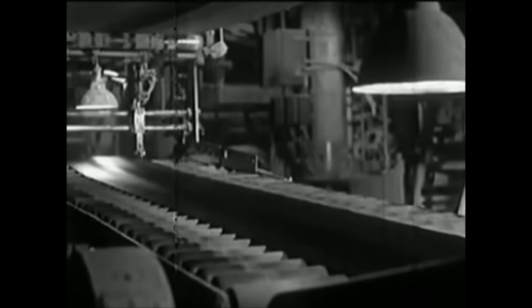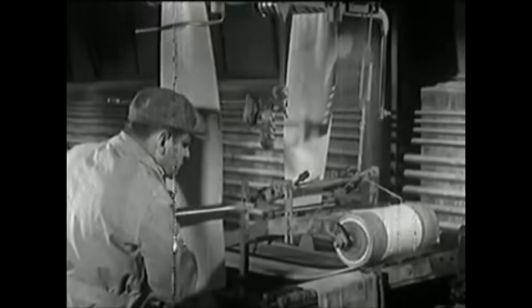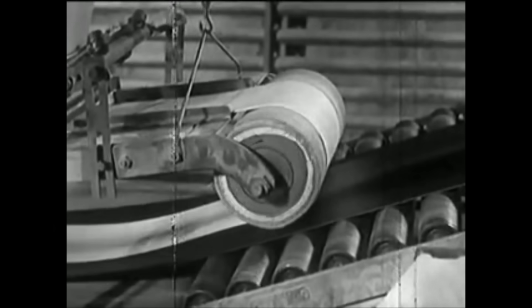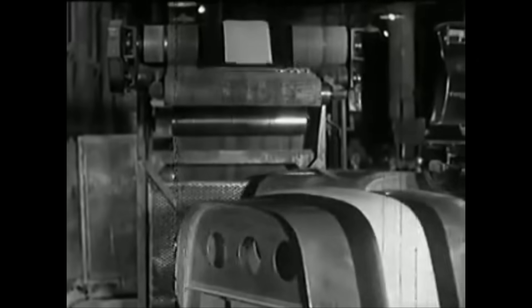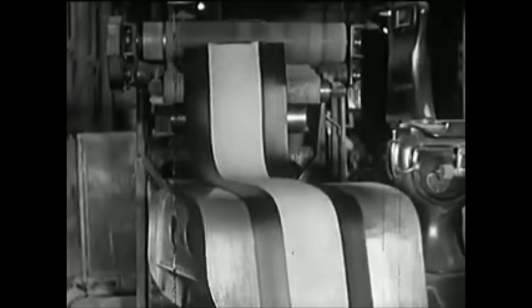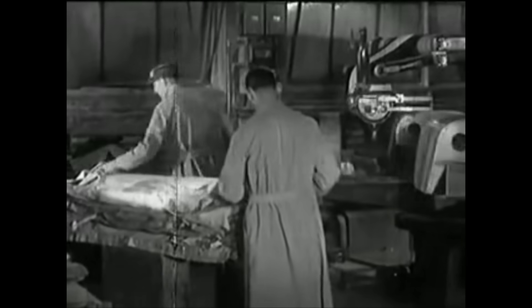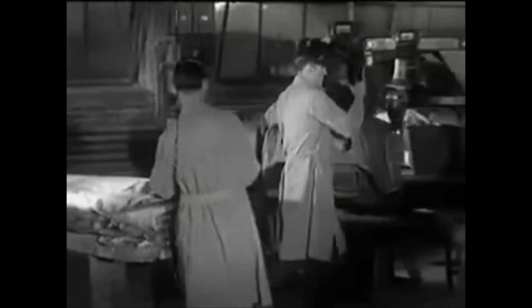A special compound of adhesion gum is next applied and thoroughly rolled onto the underside of the raw tread strip. This layer later becomes part of the double shock absorber unit which provides positive adhesion between the tread and the carcass. At the end of this long conveyor is an automatic cutting machine which measures out and cuts the tread stock into the exact length required for different sized tires. A further check is made on the weight of each strip of tread stock to assure proper balance — if the weight is off a fraction of an ounce, the strip is rejected.